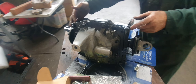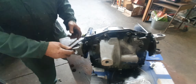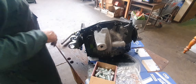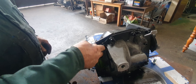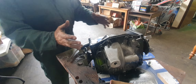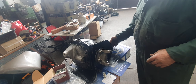This is made to the correct width — we made a note of what you said. The unis will fit this flange. Here's some servo clips. This is all silastic, no oil in it of course. They're lock tied in. This is supported up this end off this sandwich plate — the box there and there — all flush through here so you can get the thing on. And that'll all marry up. It's the same length, same flange, spigot diameter.